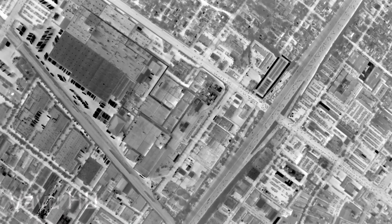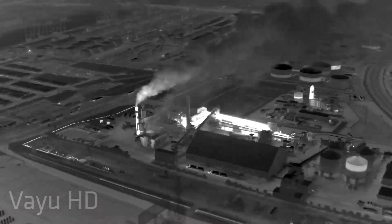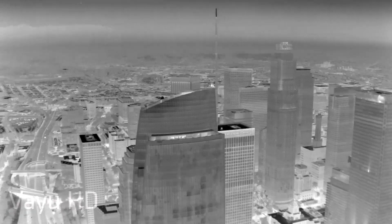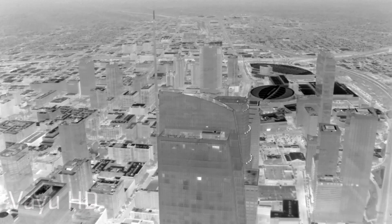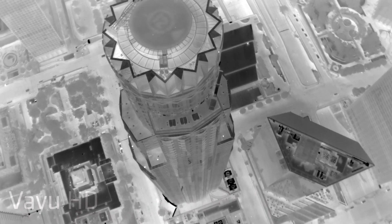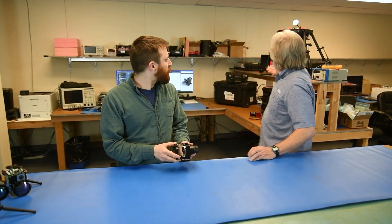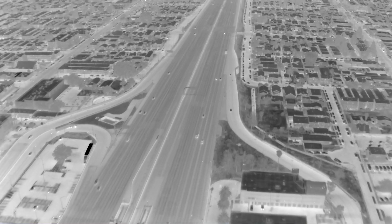The target market for this camera is aerial integration — it's so small and light, and the package is designed to be easy to mount on stabilized gimbals or other aerial platforms. It's designed with integrators in mind, featuring a standard suite of connectors standardized across Sierra Olympic's product line, easy-to-implement protocols, and mounting holes on multiple sides for integration into platforms like drones. The large pixel field also means that in an aerial ground-scanning application, you can have a wide field of view while still maintaining a large number of pixels on target.